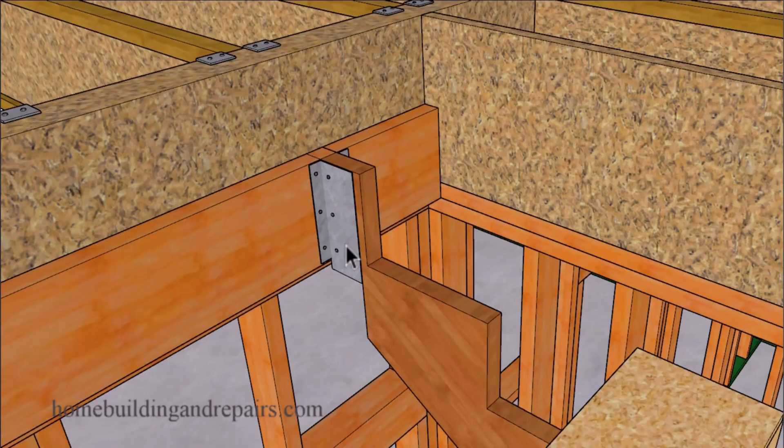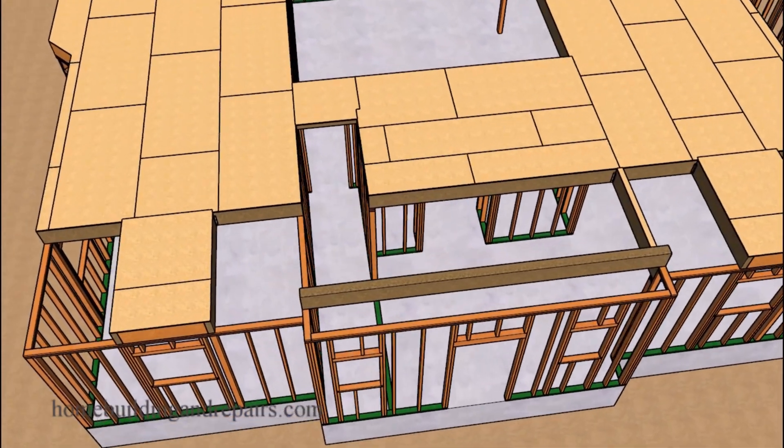And I'm not about to suggest a larger hanger might not be the best option on longer stair stringers that might be heavier — something 4 by 12 or larger. However, for a notched or unnotched stringer that's going to be less than 10 feet long, you're probably not going to need a heavy duty hanger or even a hanger period to connect the upper stringers to a ledger, floor, platform, or landing.